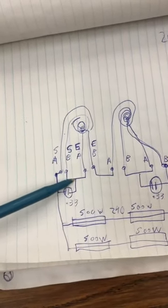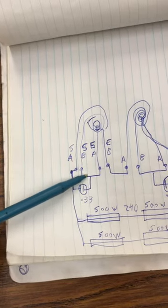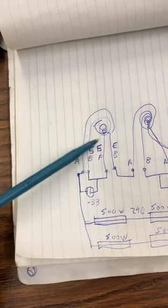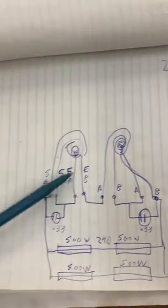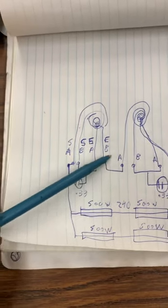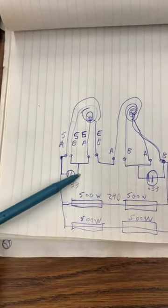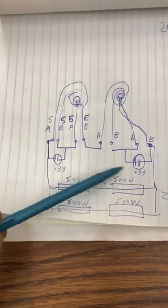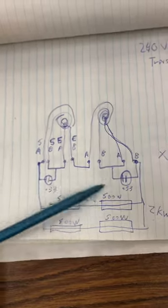And as you can see, it's wired a very special way. The first capacitor goes across the center tap and the start of the coil, and then where the two coils join, there's no capacitor across this center tap. I haven't experimented there — maybe I'll find I could pop another cap in there — but as displayed, the original design is like this.